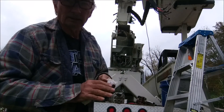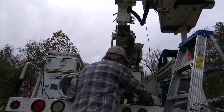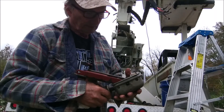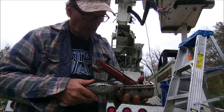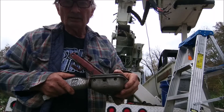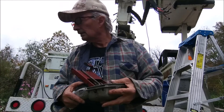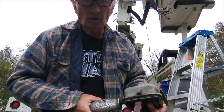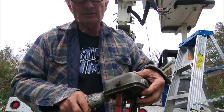Here I have the top part of the control valve and I'm squeezing the handle to see if I'm getting any air pressure out of that piston — and surprisingly I'm not. But if you flip it over, you get air pressure, so there must be a check valve in there. In this orientation, air comes out and you'll feel some air pressure, though it's not much. I'm not sure how it triggers the valve.